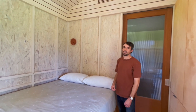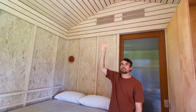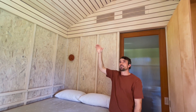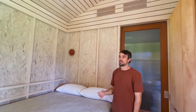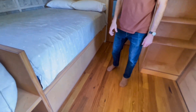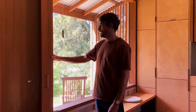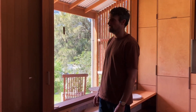And that's a single coat. The ceiling is clear pine — we've spaced it out in a batten pattern. It's got an acoustic backing behind the pine, so when you're inside the studio there's sound dampening and it adds to the quietness of the space. We have on the floor Australian hardwood, which is blackbutt and it's finished in an oil. We've got hardwood windows and they're double glazed with Viridian Lightbridge, which is a high performing glass.